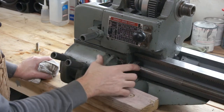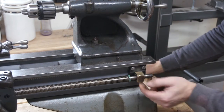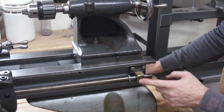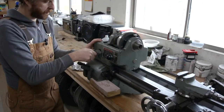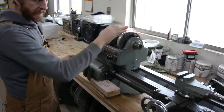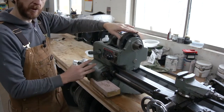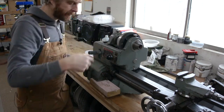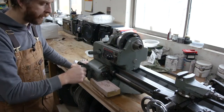So it's fed in through and it is fully engaged in the gearbox. And then on the far end I ended up finding a fairly good deal on a commercial lead screw bearing. I think I've got everything in place now where it works and works like it's supposed to - I'm not getting any weird binding. The gear alignment seems good, so I think this is the exact location where I want to put this gearbox. It's mounted with 3 bolts - 2 through the front and then 1 down through the top. I don't know how I'm going to do the one from the top.